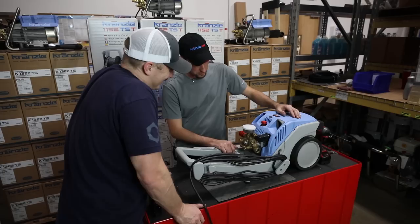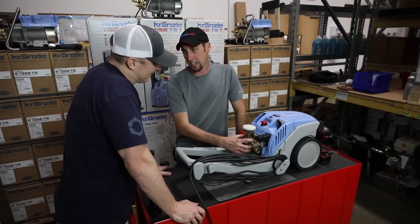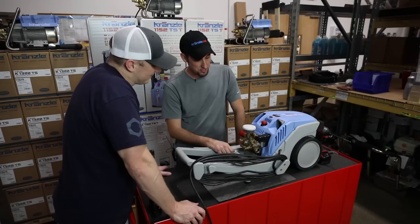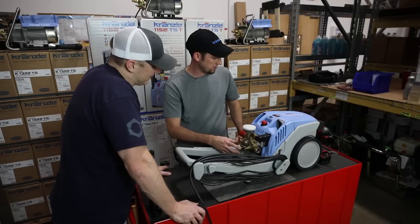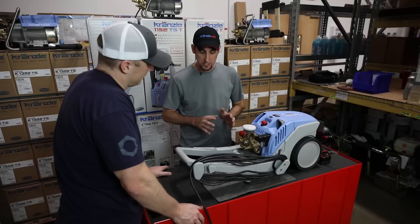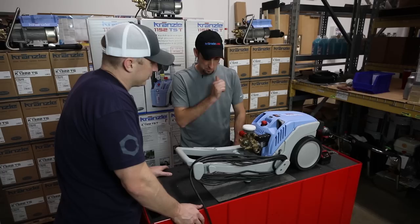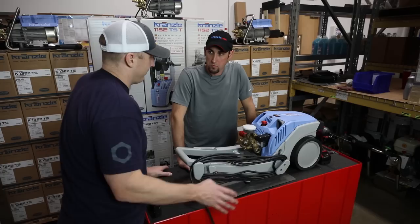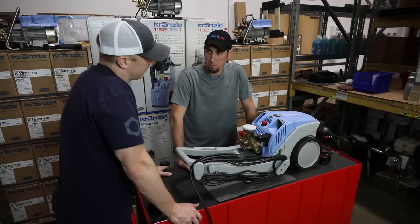That's a tiny little pump head — does that mean it's bad? No. In a lot of new consumer pressure washers, the pump head isn't any larger than this, and theirs is made entirely of plastic. This is machined out of a solid brass housing, and that is the key to the long life of the pressure washer — good transmission of heat, withstands cold and freezing temperatures well. I'm reluctant to describe it as freeze-proof, but it's as close as you're going to get.